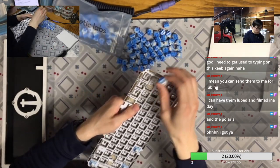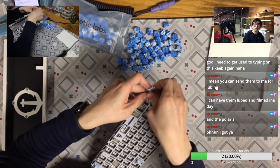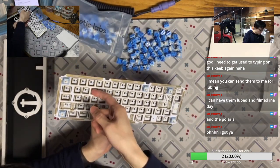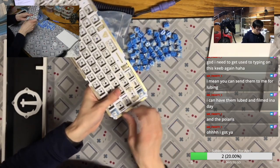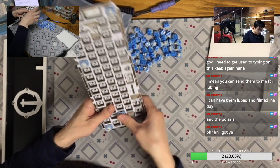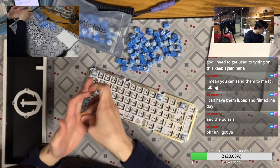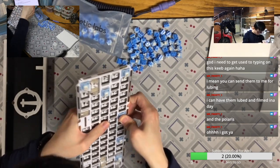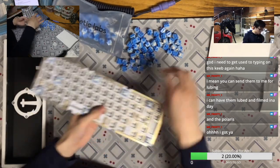So the Penguin switch is basically the Ergo Clear, the JWK version of Ergo Clear. If you don't know what Ergo Clear is, it's basically the Cherry MX Clear with a lighter spring. That's the original Frankenstein switch that people like a lot. In general the MX Clear stems were better on the tactile feeling, but sometimes a little bit too heavy on the spring. So they used the Cherry MX Clear switch and ran it with a bronze spring and ended up with really great tactile feeling and not too heavy a spring. So that's called Ergo Clear.